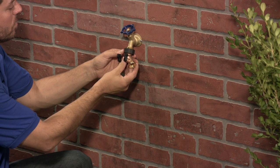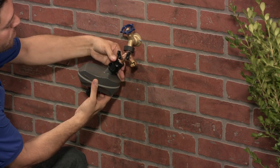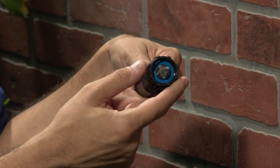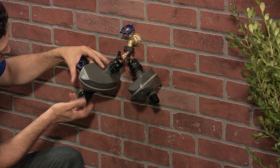I'm cheating here because I just bought two hose bib drip connect kits with hose end timers. I'm starting here at the hose bib and screwing on my Y. Now I'm putting a timer on each side. You may need a swivel adapter to make this work. On each of these items there should be a little rubber washer. You can pick up a pack of these rubber washers cheap on sprinklerwarehouse.com — I highly recommend you throw a pack in your cart, just in case a washer fell out during shipping, and also to have as replacements for when washers get old, which they tend to do.